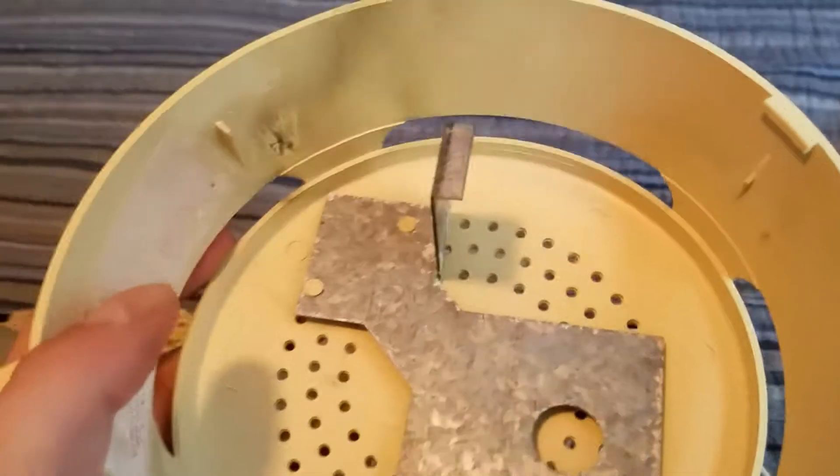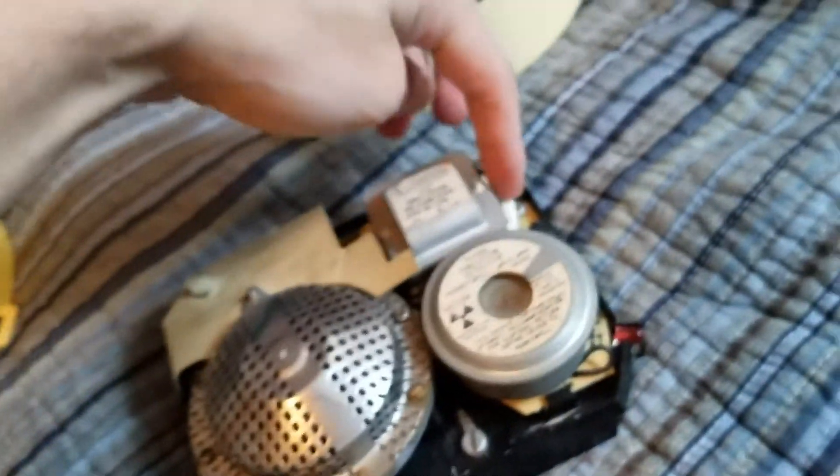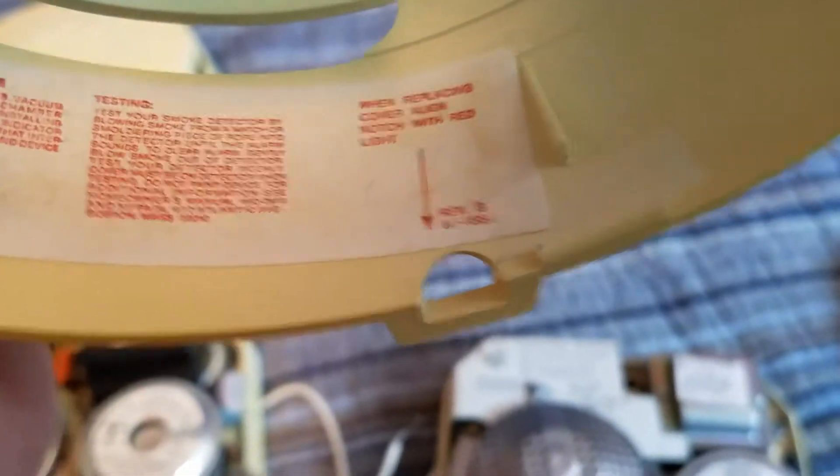On the inside of the cover you can see it has that plate and there's the tab that pushes down on the cover interlock switch. However, on mine there's another little tab that goes on the other side of the transformer - I thought it was to keep the line cord down - but these both only have the one tab for the cover interlock and don't have that other tab. The label on one of these has been torn up and scratched up and you can barely read it, but the other one's label is still intact and it's identical to mine. The revision label is 97-1554, although the font is a little bit bigger on mine.